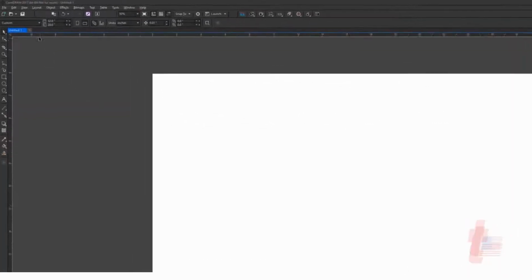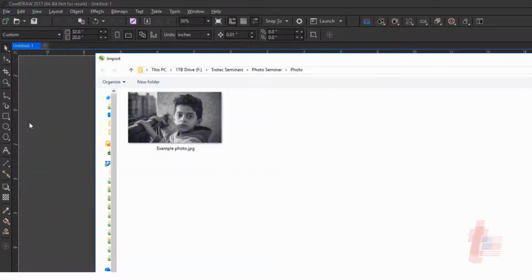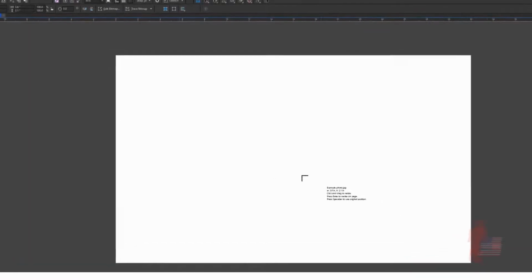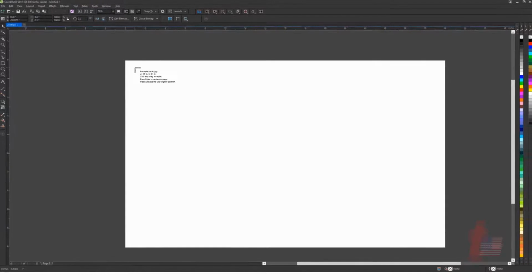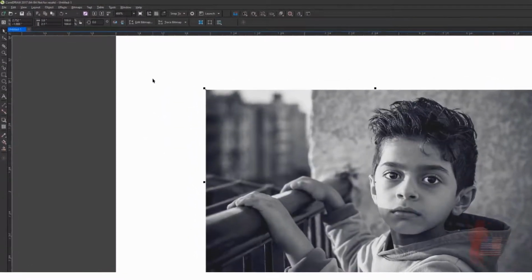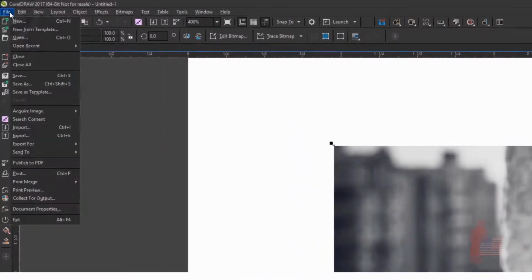And to use them, I'm just going to open up my graphic or import my graphic directly into whatever design software I'm using. Now, it really doesn't matter at this point. You can run from Microsoft Word, or you can run it right out of Photoshop or Corel Photo Paint and then send it right to the laser. Ideally, you want to use software to crop it or size it down to the size of the graphic. In this case, I've got a 2 by 3.5, which is a business card size, and I'm going to engrave it onto a piece of black anodized aluminum.